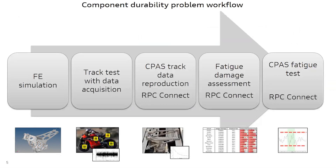As mentioned, we want to perform a fatigue test on the seat support with higher accuracy in reproducing the fatigue process for this component. Higher accuracy allows us to reduce the safety coefficient for fatigue calculation, thus removing some weight from the component. To achieve this higher accuracy, we need track data on one side and a good correlation with the FE on the other side. We simulated our component in the FE environment, imagining an inertial force applied to it and calculating the points on our component geometry with the highest amount of mechanical stress.